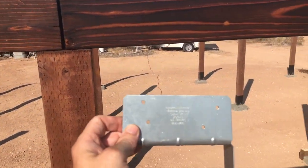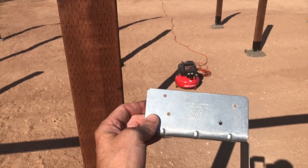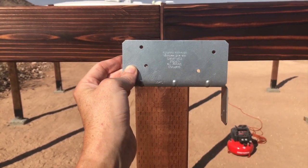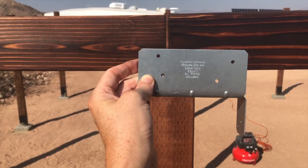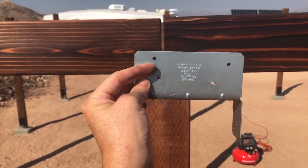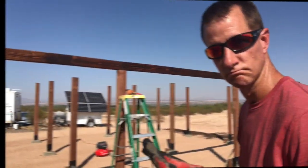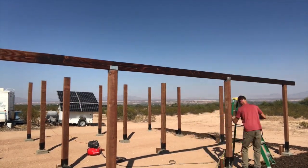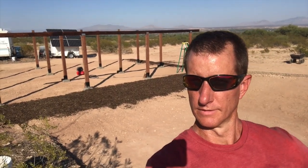So that's what I'm about to attach. I'm going to use a palm nailer — thanks to Craig and Nicky for letting me borrow it. It is a device that runs with an air compressor, pneumatic. I'm going to use three-inch nails. Those nails being three inches long could bend with a hammer, and a nail gun isn't for precise stuff like this — if I used a nail gun I wouldn't be able to hit this little hole right here. But with a palm nailer, I can load a nail into it and put it up against the hole, and it'll da-da-da-da-da. So far it does want to jump around, so you've got to hang on to whatever you're nailing in. And there's one row of four — three more just like that.